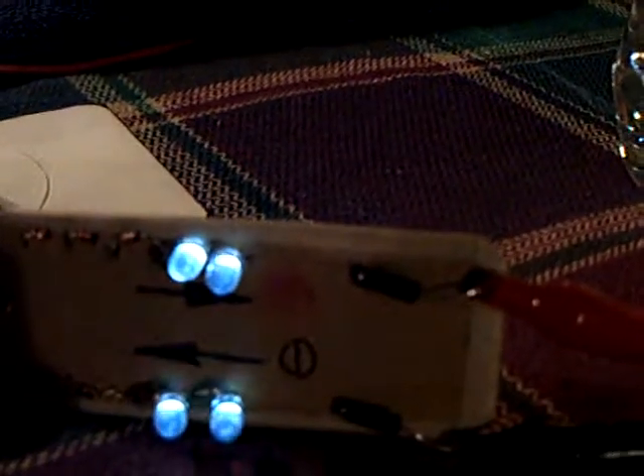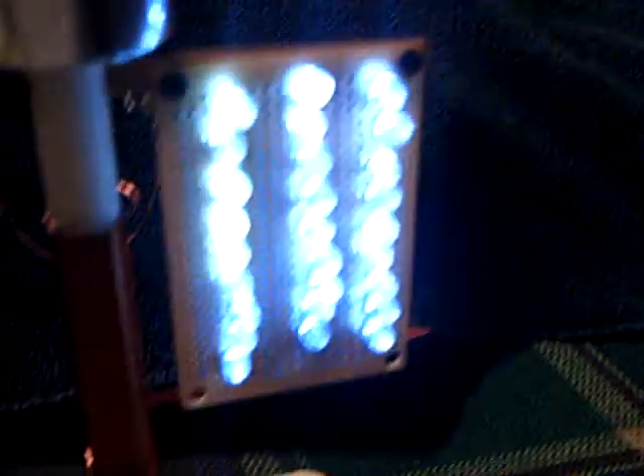I'll put this inductor back in, change the frequency, and everything will come back to life again — there it goes. Same thing on the other side: as I change frequencies it goes back up. Look at the power — it's absorbing more power too. I just wanted to share with people that this little tunable inductor with the ferrite rod gives you a way to tune this new exciter circuit. Thanks for watching.